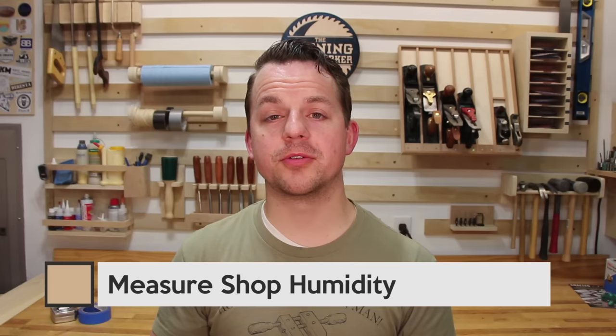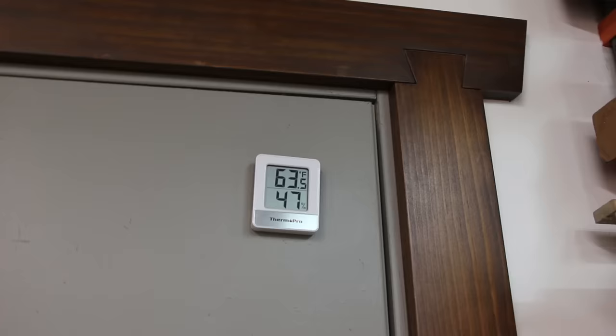Here's a tip you may not think about but it comes in really handy when you're worried about wood expansion. In certain areas of the country we have temperature and humidity swings that are really big. It's good to know the temperature and humidity in your shop throughout the year so you know what times things are going to expand and when they're going to contract. I got a cheap temperature and humidity sensor on Amazon and now I know the range in my shop because I see it every day.